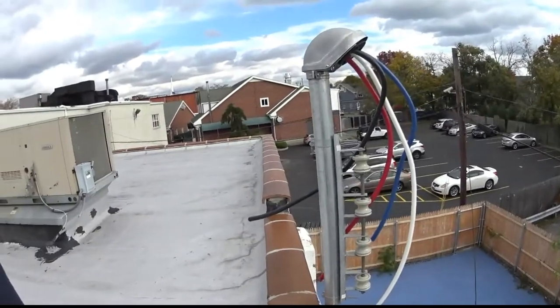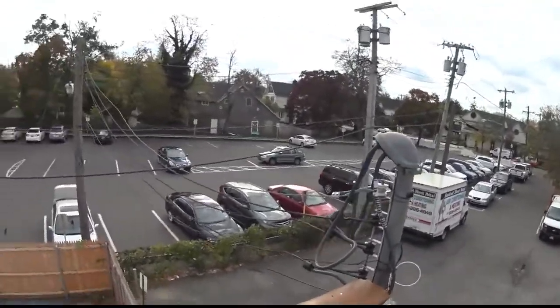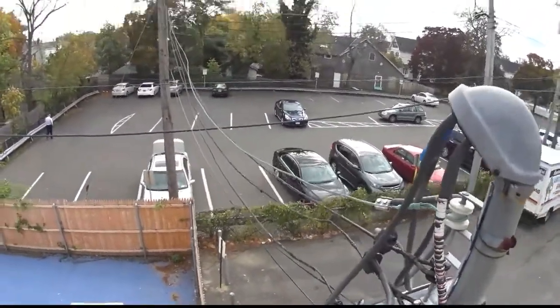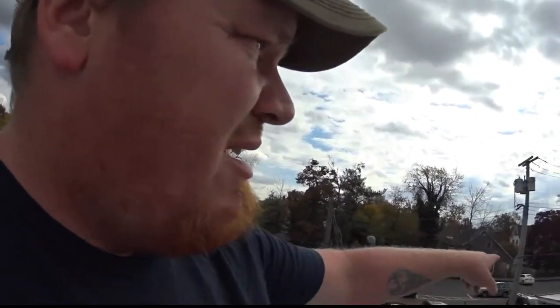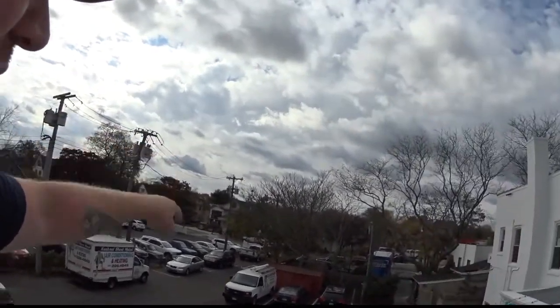So right now, these are my leads to the building. He's breaking everything up. This is the old mast, which, I mean, that is some scary looking wire. Sorry for cursing. But this building has a 3-phase delta setup, so it does have a high leg on one of the legs. They're looking to go to a 3-phase Y, so that'll be all 120 volts on all 3 legs. So they actually have to take off of that leaning pole, take off of one of those transformers and extend over to the other to make that changeover. So they are going to look to do that.